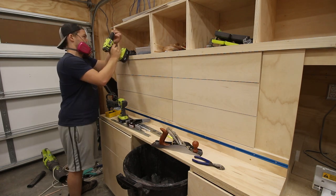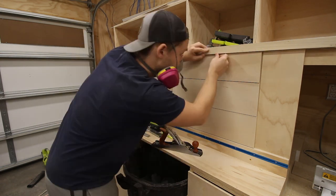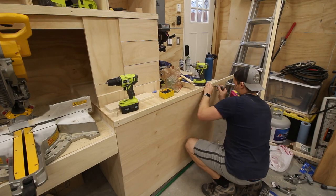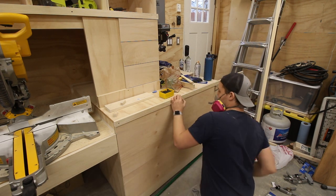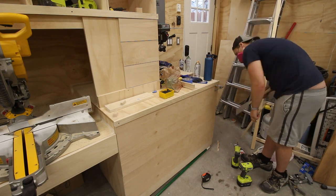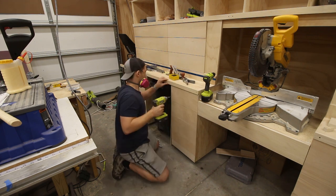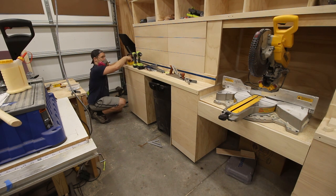The last step as far as the build goes is installing the trim pieces of hardwood above the upper drawers and along the cutting work surface to protect them from dings, dents, and abuse. I ended up using Poplar for the time being, and just secured this with trim head screws and no glue, pre-drilling my holes of course. I say for the time being because I may want to swap this out for walnut or cherry at some point when I have the appropriate size scrap, but I didn't want to go out and buy a board just for this, so Poplar will do for now.